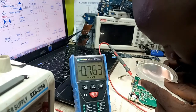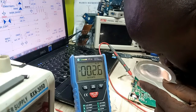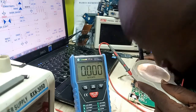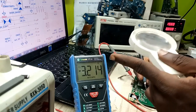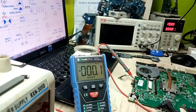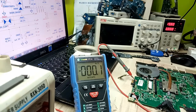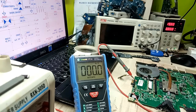The next thing is to check the AC OK signal, which is pin number 10. Counting from pin 6 — seven, eight, nine, ten — this is pin number 10. On pin number 10 I have 3.3V. Under normal circumstances on this board, it works with lower logic, which is 0V. Right now I'm reading 3.3V instead of 0V on the AC OK pin.